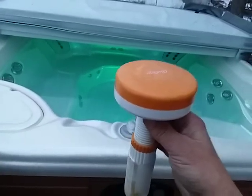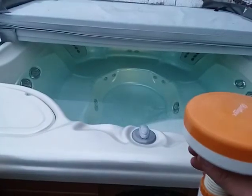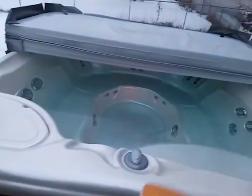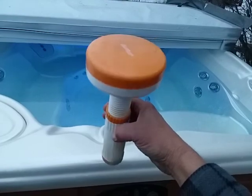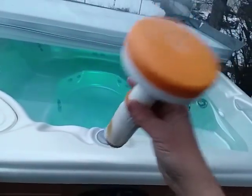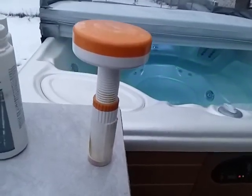These are just eating out these spas. I have seen everything from pump seals eaten out, heaters pitted out, moto massage jets blistered shut, undersides of covers blistered like bubble wrap, and shell distress — actually etching at the waterline. It goes on and on. The use of these tablet floaters in many spas is not only ill-advised, but the manufacturer strictly forbids them. This particular manufacturer says that the use of such sanitizers will outright void the warranty of your spa.